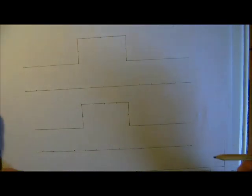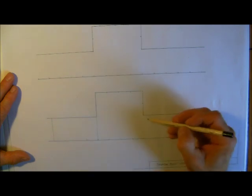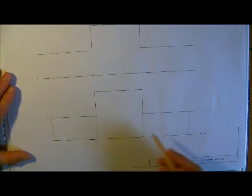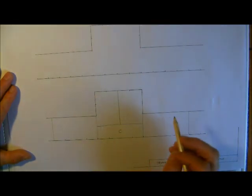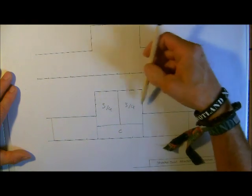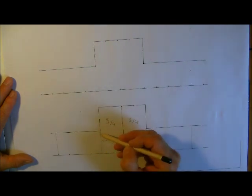So we will just quickly look at the attached piers, and first of all we are going to go for the common one. I will start off with what we had on there — this is a plan view by the way, the previous two drawings we saw were in isometric. So this is what we are going to have for this arrangement. And again you remember with the miniature bricks — the back of the pier has two three-quarters in it, and the face elevation is unbroken half bond or stretcher bond, which looks good.